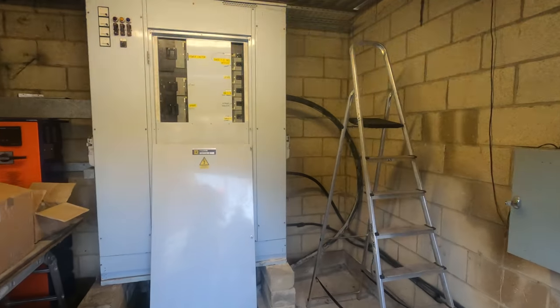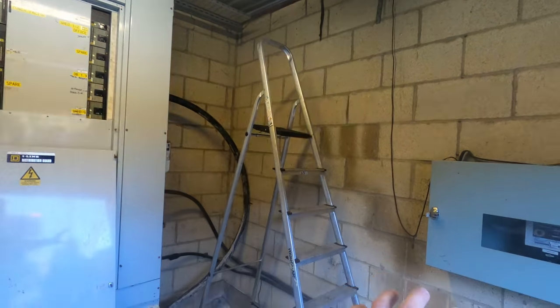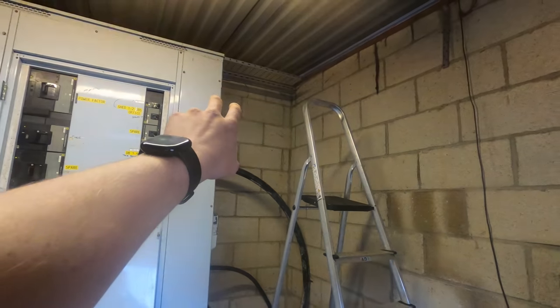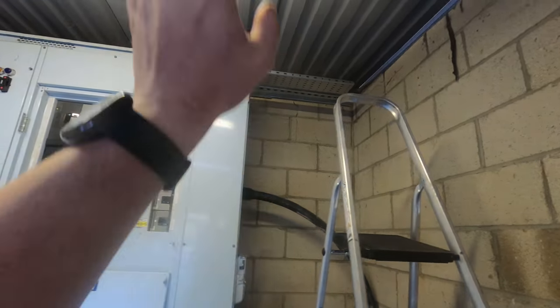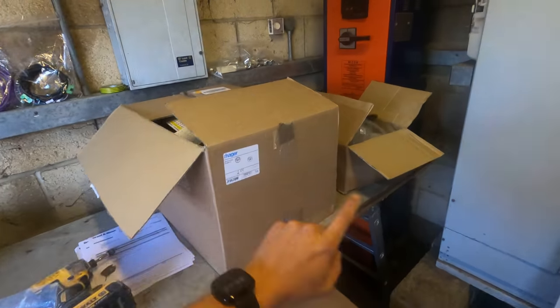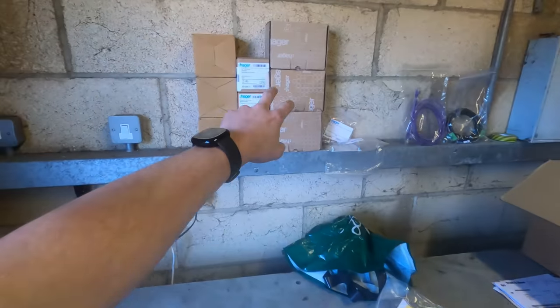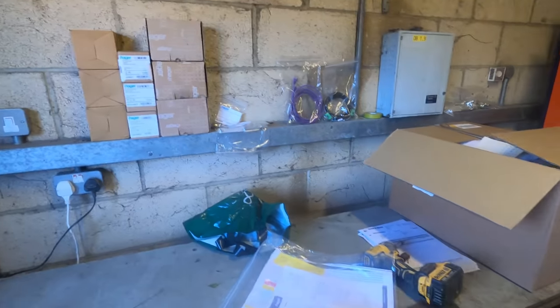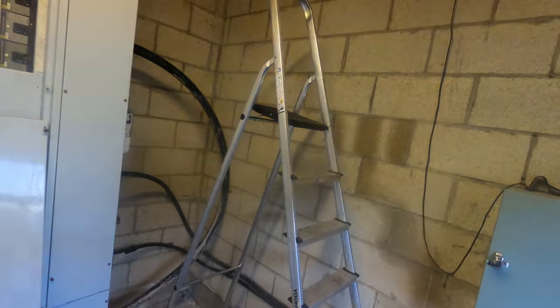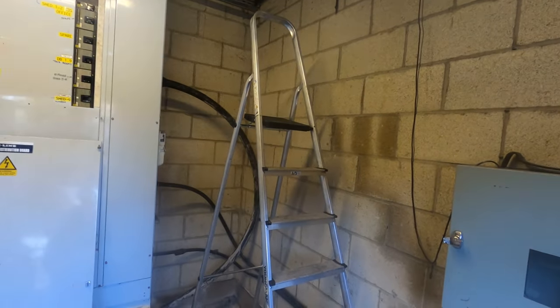Right, so this is going to be our hole for today. Obviously, you've seen all this before, but today we're going to have the MCCB board mounted here, 9-inch trunking coming round up, and we're going to flange it into the side of this panel. Probably won't do that today because we're going to wait until this is isolated, but we can get most of it prepped. We've got our 185 tails, our board, our side extension, incomer kit, CTs for the main incomer as well, and all these other little MCCBs and CTs for them and stuff like that. So yeah, it's going to be cool to show you all that. We're going to get the panel outside, start measuring what we've got to do with our uni and stuff like that. And then we'll get uni on the wall, panel on the wall, and then we'll start the trunking. So yeah, we'll get going.